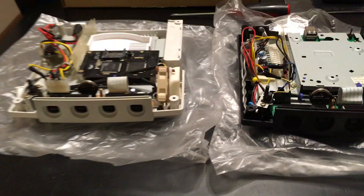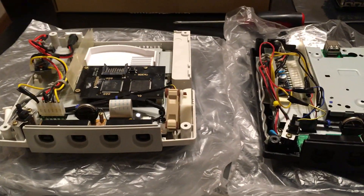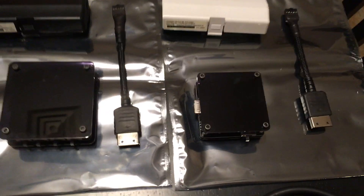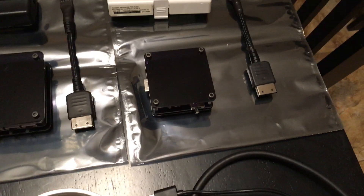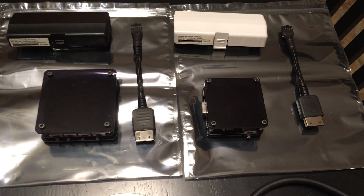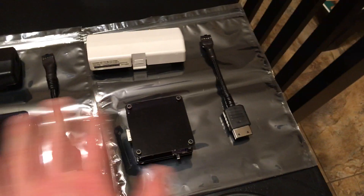Now I want to talk about what happened today. There's been a new development — they came out with a thing called the DC HDMI. The Dreamcast natively outputs VGA, and VGA is a non-standard video format for HDTVs. What we've been doing in the past is using these boxes by the Beharbros — this one is the Akura and this one is the Gekko — which convert VGA to HDMI for your HDTV. The problem is the video format isn't a real TV format, it's more of a computer format, so there are issues where the entire picture will shift slightly to the right, some stuff gets cut off, and some TVs you can cycle power to fix it and some don't.